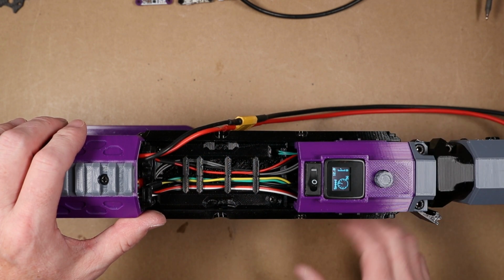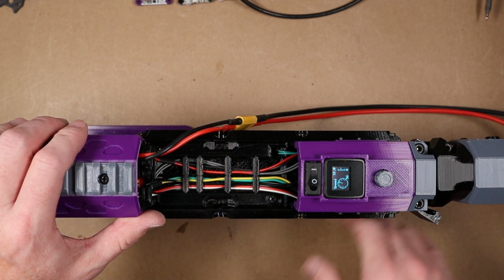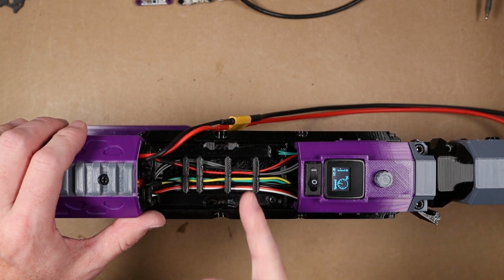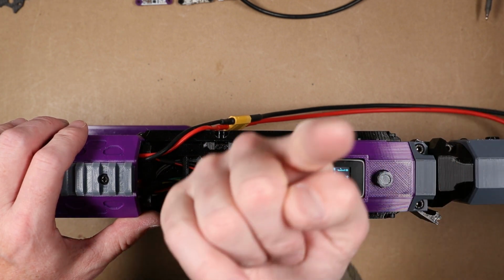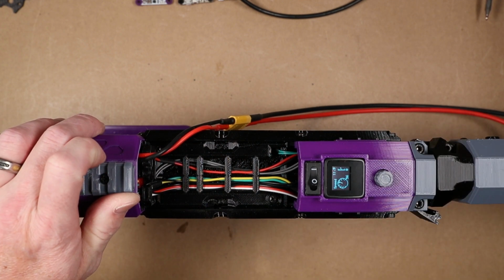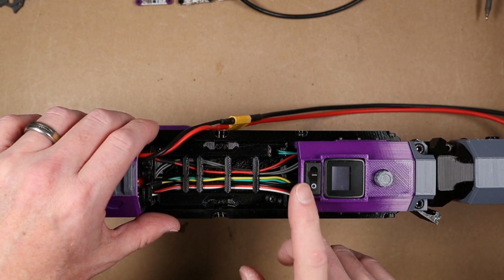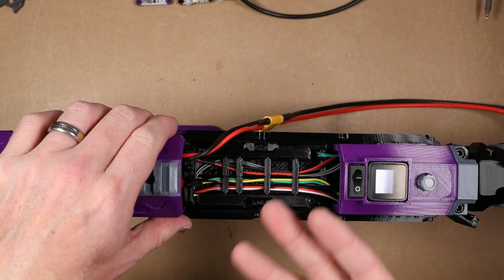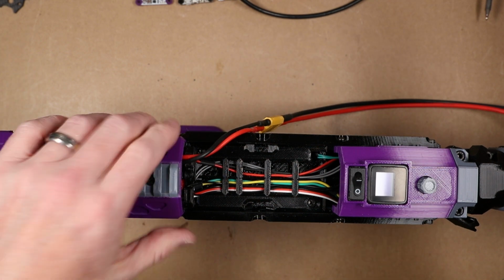What had happened to me is I hit the trigger button here, and I'll do it right now. And the reason why it just did that is because it's current limited and the gun was calling for more than 3 amps, and the power supply up there is not allowing more than 3 amps, so it was just like, yeah, piss off. But anyway, initially, what had happened, I flipped this switch and I got nothing out of it. So let me show you how I went ahead and diagnosed the problem, and I'll show you just why that is.